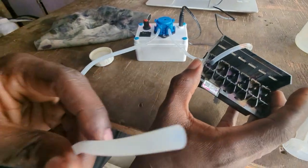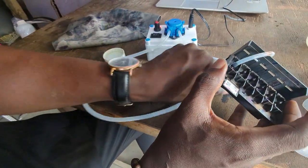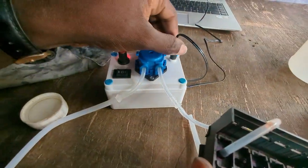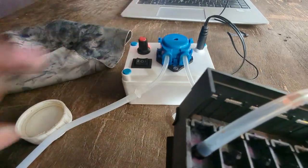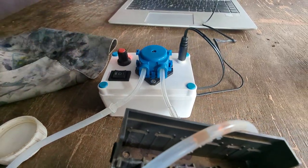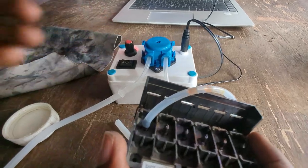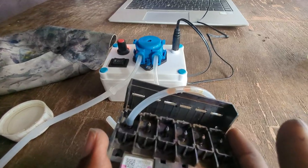This is my intake pump. In the first case I'm going to let it just pump air into the cavity. It's connected by a switch that goes onto the wall — not a lot to it. If you press the button forward it begins to push out, and if you press the button the other way it begins to suck out. So pressing down pushes air into the printer head, pressing the other way pulls air from it — effectively both motions you need to clean your printer head.